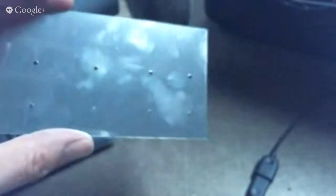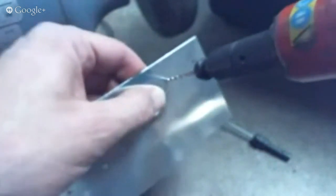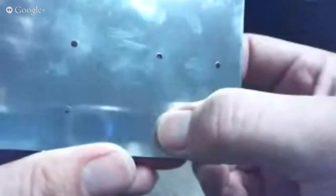This is the pre-punch tool. I'm going to drive a reamer through that hole — running a reamer to enlarge it from the pre-punch number 43 to number 40, which is what the reamer is. I'll switch drill bits and do the top hole with a drill so we can see if there's a difference. A lot of times when you ream the hole, you'll get very, very little burr on the back side versus the drill bit, which leaves kind of a tear-out — more of a triangular shaped hole.